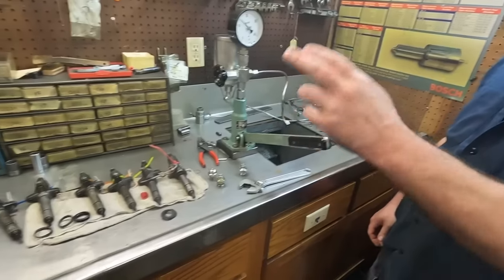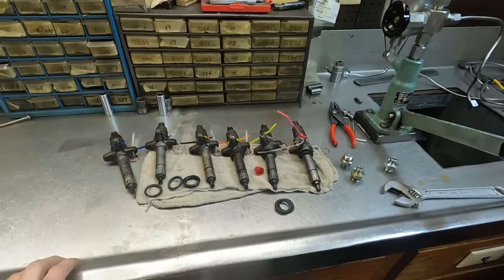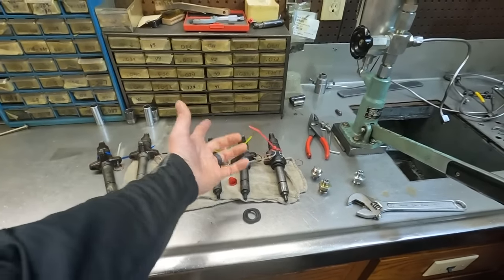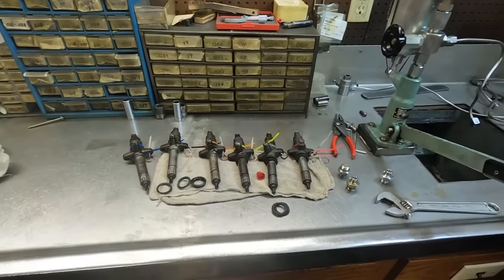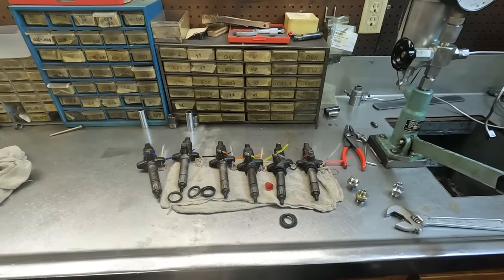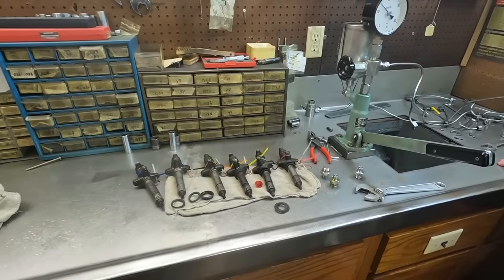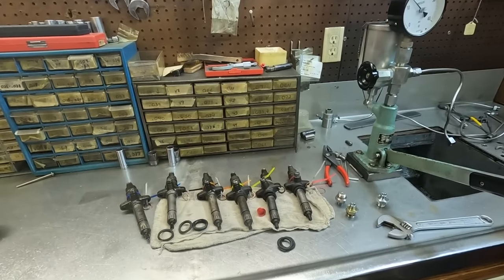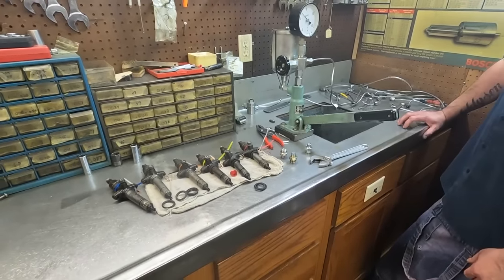If you had just one doing that flutter, you'd notice it on the engine. Well, that's good to know. So if you guys need your injectors gone through, they're not just going to fix one of them and send it back to you. They're going to give them all to you so that you get the same exact kind of pattern in each cylinder. If we put a new tip in one, we'll put new tips in all of them. Because you just really don't want to mix and match used tips with a new tip. Just the action on the engine will be different. Makes sense.